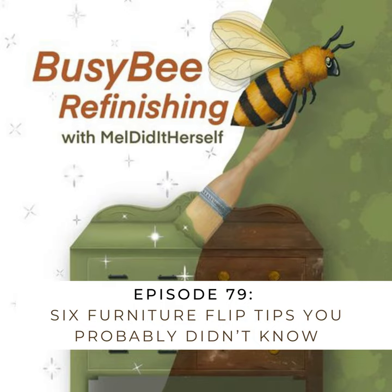Take some wood filler — you want it to be a stainable wood filler, and ideally roughly the tone of the wood you're working with. If it's a lighter wood, golden oak, or dark mahogany, get a wood filler in the same color family that is stainable. I like to use Elmer's — it works great. Put some into a separate container and mix it with water until it's a liquidy consistency that you could brush over the surface, but not thick like a paste — watered down closer to what you'd do for a paint wash. Then brush that over the surface.